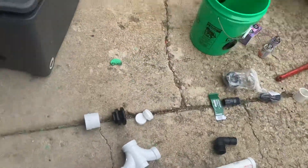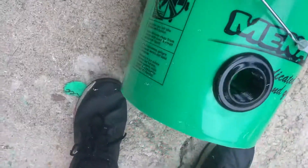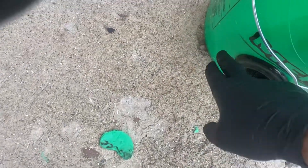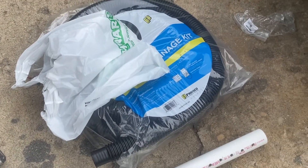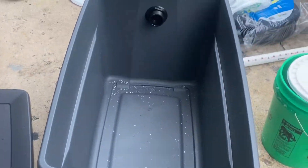If you want to do a smaller version you could use a five-gallon bucket. I made one with threaded fittings on the bottom and top — it's for chlorine distribution but works the same as a sand filter. Because the bucket is curved it doesn't quite mate flat, so I used a torch, warmed up the plastic until it was flexible, and flattened it out. Then the bulkhead attaches to that flat spot with a nice tight seal. Inch-and-a-half regular sump pump hose is what I'm using for inlet and outlet. Under a hundred bucks — you just have to figure out the layout and what size bucket you're going to use.